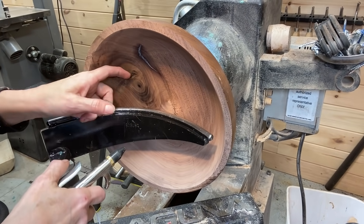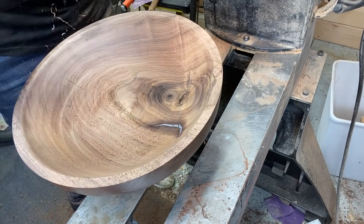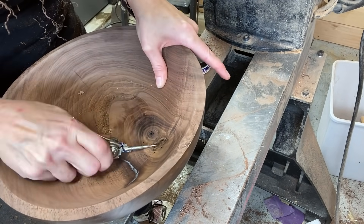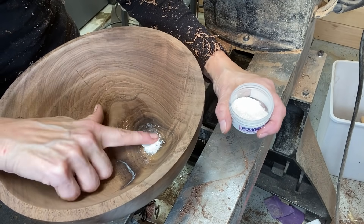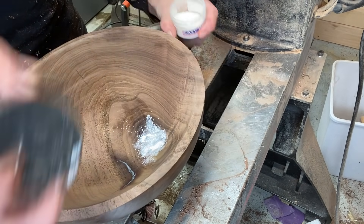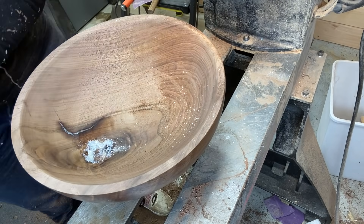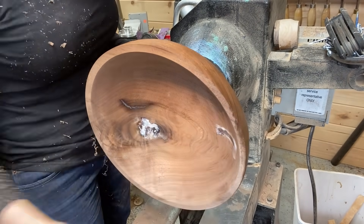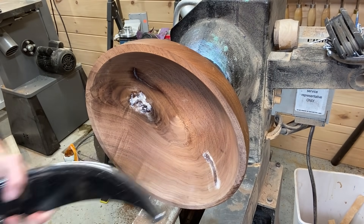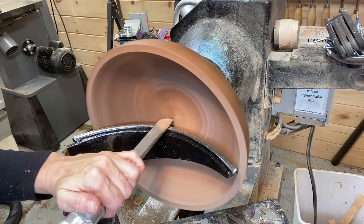There are a couple of cracks or blemish-type areas that I need to fix before I move on. So again, I'm going to use the Easy Inlay process with the Starbond CA glue. This was pretty straightforward since I could take it off the lathe and lay it flat — made it pretty easy. A few little cracks that are probably harder to see on camera, but I went ahead and fixed those as well, put it back on the lathe with the curved tool rest, and finalized the inside.